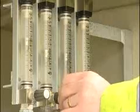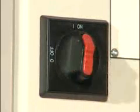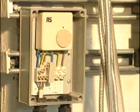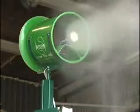Once the Aironaut or ProSorb is put into the tank, simply set the dilution rate on the blue Venturi pump unit, set the flow rate on the flow meter, and switch on. To further increase the ease of use, an optional timer unit can be added. The unit will then keep operating at optimum conditions until the agent runs out.